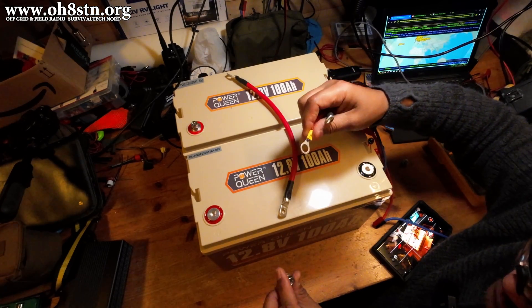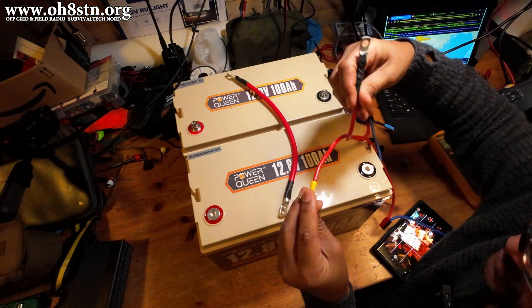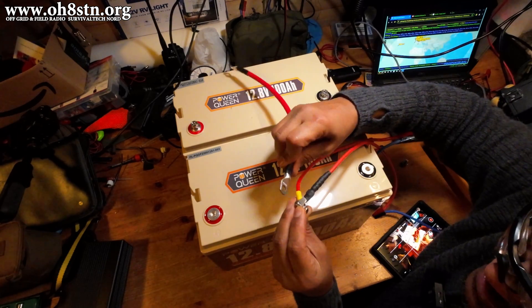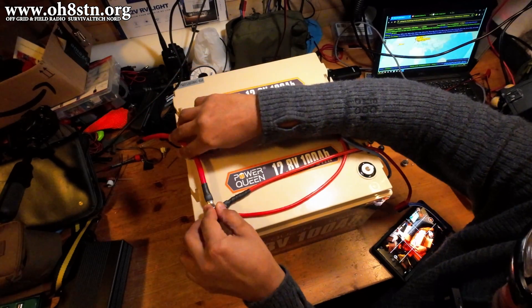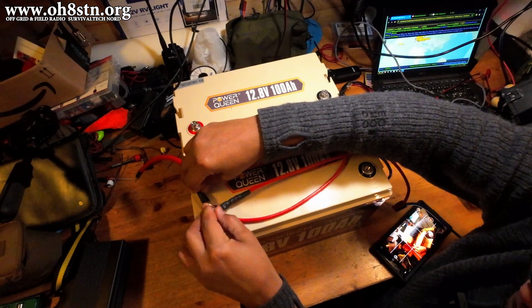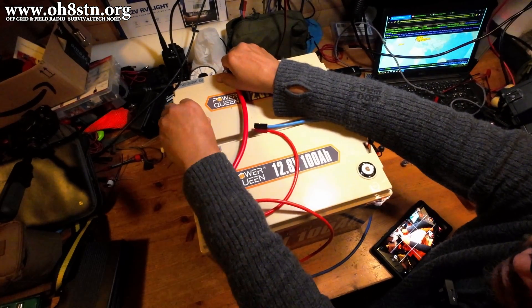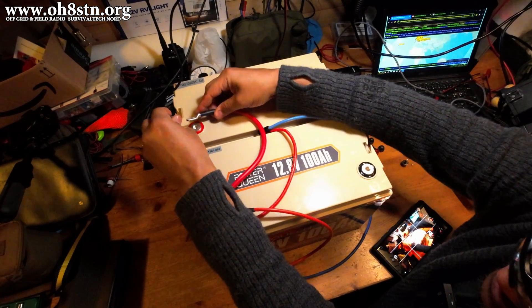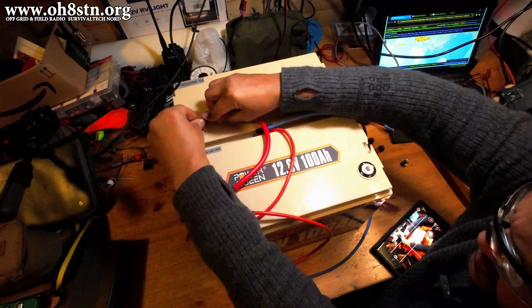The first thing I'm going to do is take all the positive leads including the jumper. I'm going to place them on the mounting screw, making sure all of them are the correct positive leads and the jumper, and hand tighten that on the battery terminal. Now I'm going to connect up the positive battery terminal for the second pack. There's only the one lead, that jumper cable, on the second pack.